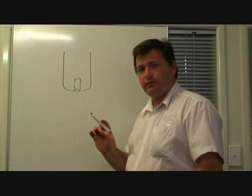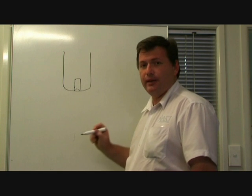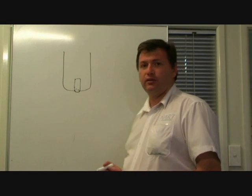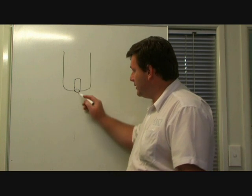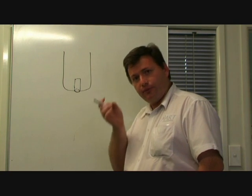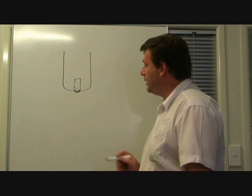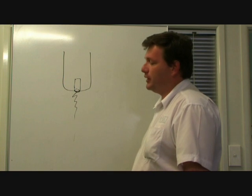In fact, what happens when the plasma is cutting, this hafnium metal forms a small bead on the end of the electrode. Now, it's actually the little bead of molten metal that's conducting the current. For the most part, they'll just sit there and it'll do quite a good job of conducting.